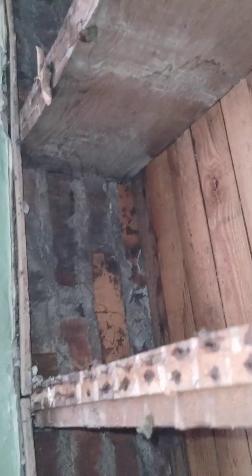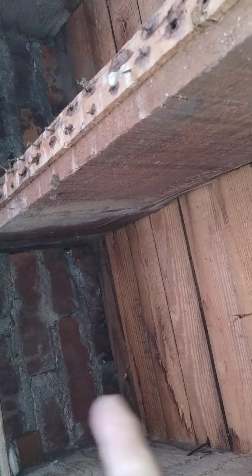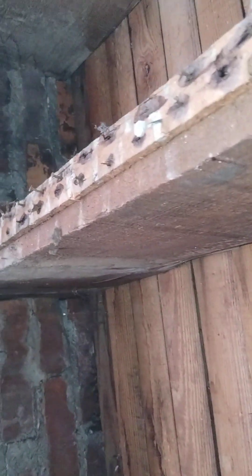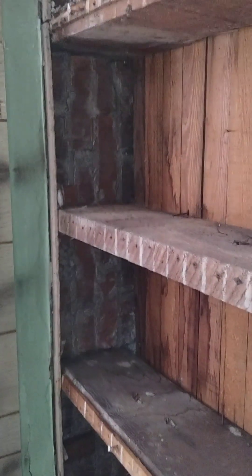Shim the floor up and you'll be okay. That is a repair. See this is a two-by material — oh, one-by, that's one-by. It's just a 1940 furring strip. You can easily tap that floor up and shim it. Jay, you're just going to tap that floor up where it's bad — get a BFH, that's a big f***ing hammer — and just tap it up. Do a small pilot hole, an eighth-inch hole, drill through it, drop a wire through so you know what you're tapping, tap this floor up, shim it to the top of the joists, and screw it down with some finish screws.